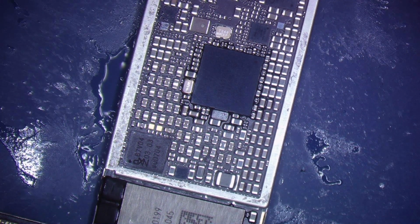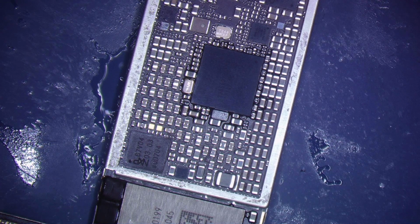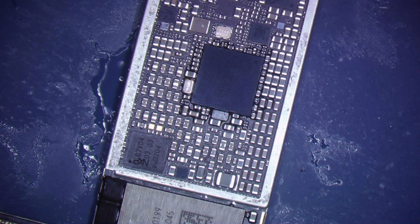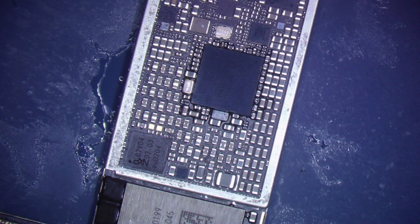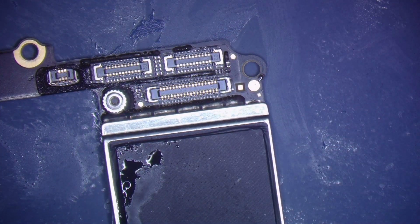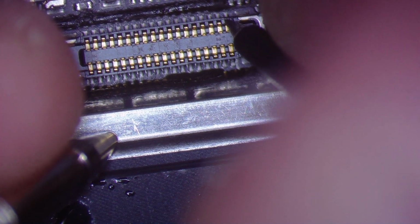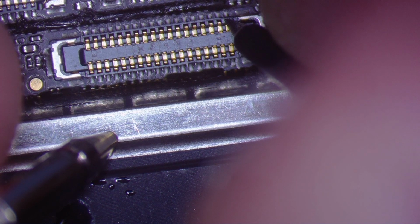All right, let's see if the short has gone away. So now what we're going to do is hook back up to our multimeter here. And again, you guys will hear the beep if the short is still there. And let's check. Again, hopefully our desired reading is like 650 or something. And I got a quick beep and I have 786, which is still pretty far off.